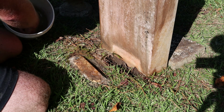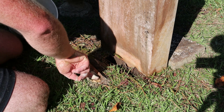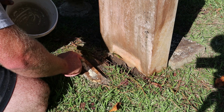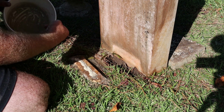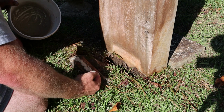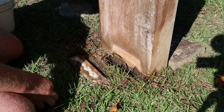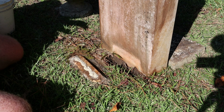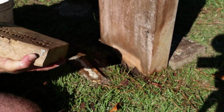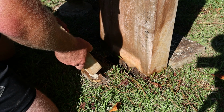You're going to take just some hydraulic lime mortar. You're going to put a thin layer on here, and you kind of want it to be a little wet. Because, especially down here, it's so hot, you want this stuff to cure slower so that it cures strong. This is going to be a strong bond if there's enough contact points, which there are quite a few. This will be a strong bond, but it's not going to be so strong that you can't undo it. And epoxy, on the other hand, is harder to undo without damaging the stone to some degree.